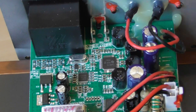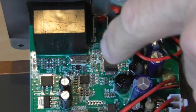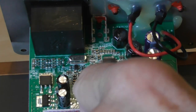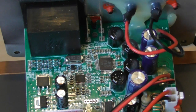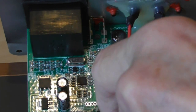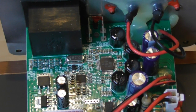I have to say it's very nicely built — can't complain about that at all, beautifully made in fact. There's the class D power amplifier and there are actually two other chips here. It does have — oh, that's interesting, there's a crystal there. I wonder why you need that. That is the class D amplifier, and I suspect that other one is for signal processing, because this speaker has extensive sound processing.